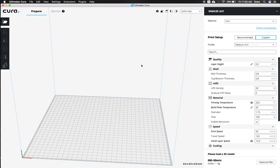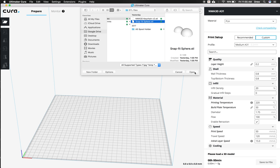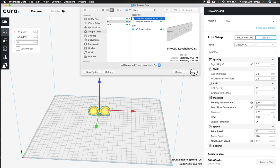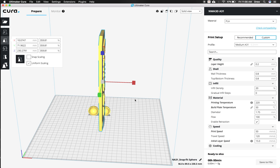Next, we're going to load a model in Cura. Click where it says Open File, go to your SD card, and open up this snap fit sphere. When it loads, you'll see the sphere — as long as it's yellow, that means it's going to print. You can click on it and move it around, and even add more than one object as long as they fit inside the build area. You can click Scale to make models larger — this is a really giant printer, so you could scale things up quite a bit. You can change percentages or click and drag on each axis, for example to set it to 150%.